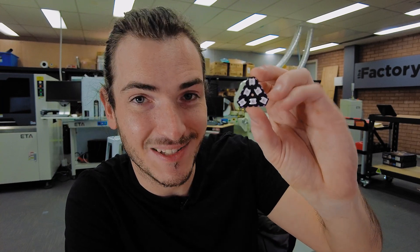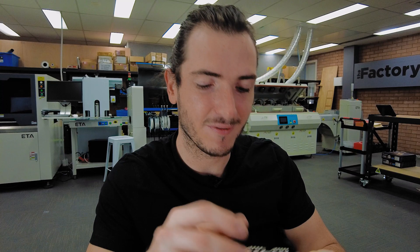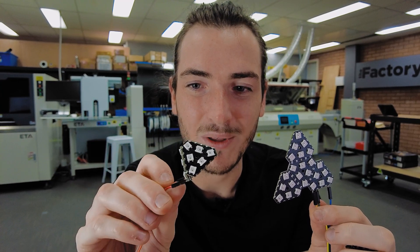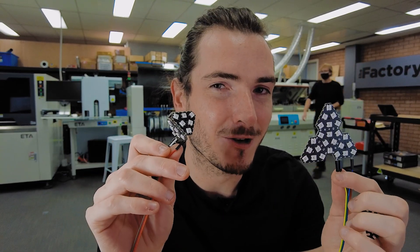A sneak peek at another tileable LED design: we're working on some tileable triangles. The idea is that you could make some pretty nice abstract 2D artwork out of these. Here we've done a little tiling test with 4 of them to make a larger triangle, and there may even be scope for 3D geometries. It's actually a trickier problem to solve because with just a three-sided object, it's hard to close a 3D volume without having pins lining up in the wrong spot — like shorting power to ground or D-out to another D-out.